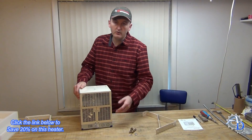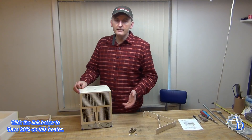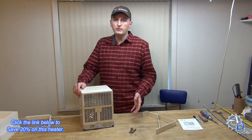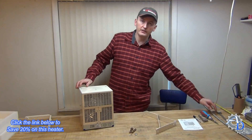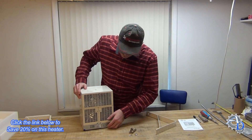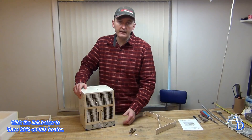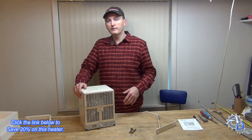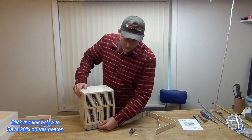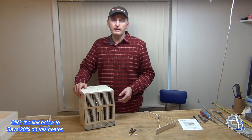Right here is the junction box. With this heater, it's going to be hardwired into a 240 volt circuit, so you'll need to run at least a 10 gauge cable or wire into this junction box using either conduit or some flexible metal armor like Greenfield. It has a thermostat — a simple control to turn it on. You turn it on clockwise all the way and let it run until the room comes up to a comfortable temperature, then slowly turn it counterclockwise until the heater just shuts off, and it will maintain that temperature.